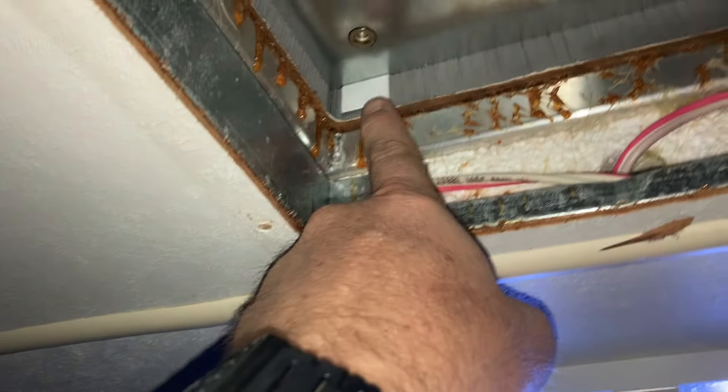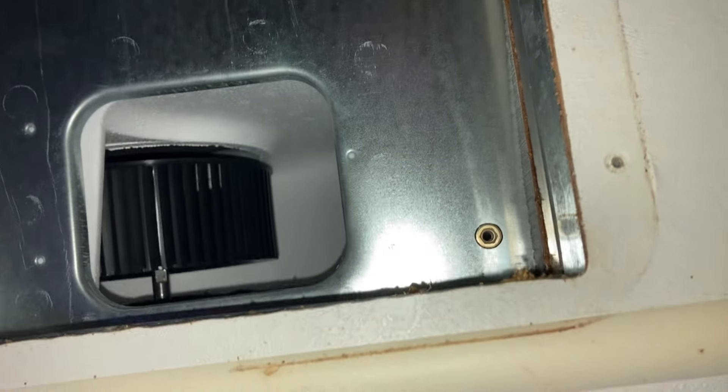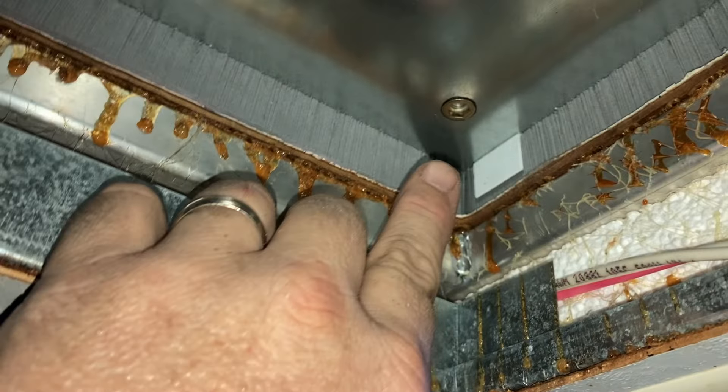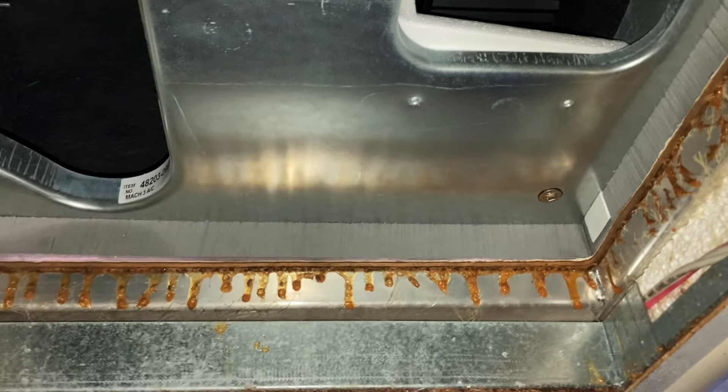Okay, that's pretty good — it's flush there. It can come over a little bit this side. So let's push it up a little bit. What that does is it allows these holes here to line up more from a vertical view, so the plate mounts flush. And basically, as we screw those in, this gasket — see how I'm pushing down on this foam right here? As you squeeze down on this foam like this, it'll act as a suction and keep all rain and debris out.